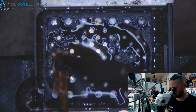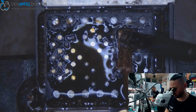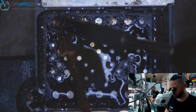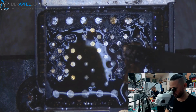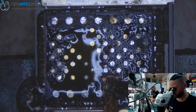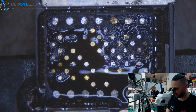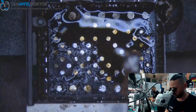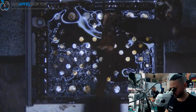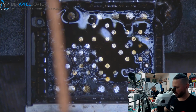So it's a board which from the condition has really soft pads under the NAND. So we have to be very careful to not lose more. Here, the pads here, I feel it. It's hard to go on here. Normally you can go even fast and hard over these pads. But in this case here, it's really about being very careful.